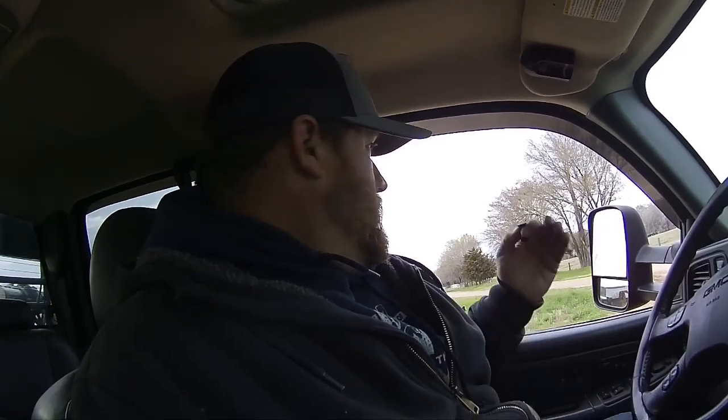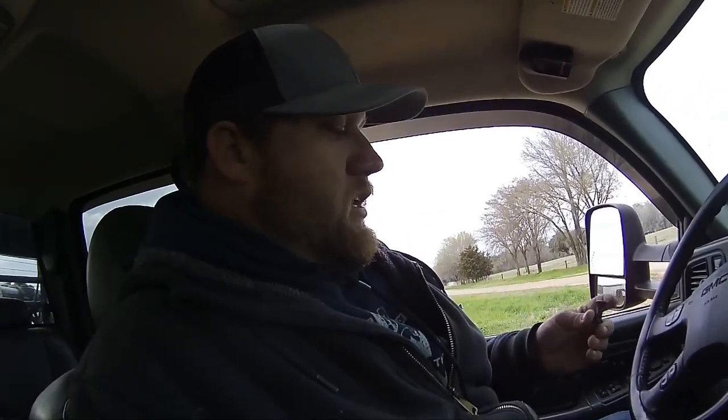Also, there were a couple of the crossbars, or whatever you want to call them, of the conveyor that must have been loose from when it was new and just never got tightened up, and so they've kind of torn each other up. So he bought some new ones. That's them right here. Just got to do like 6 or 8 of those and put some half links in the feed wagon.